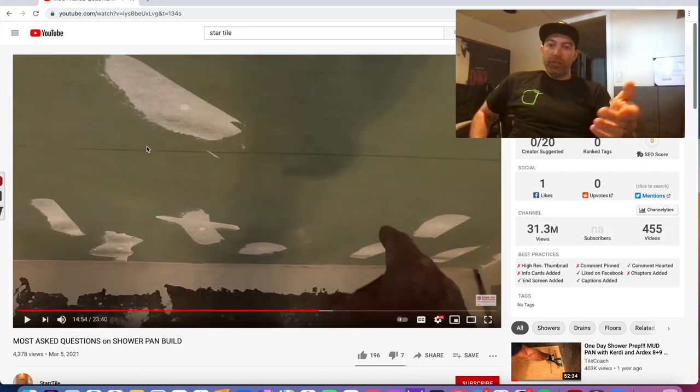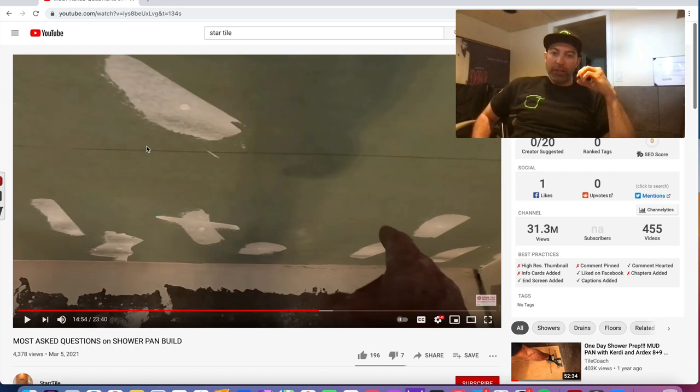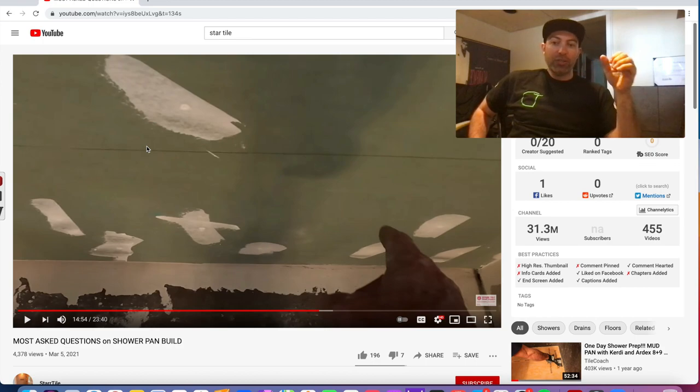So, one thing to point out right here on the video is using drywall in the shower. The only system that the manufacturer allows drywall in a shower for is Schluter. If you're going to wrap the whole thing with their Schluter Kerdi membrane, thin set that bad boy on. I've done plenty of showers that way with drywall. No problems at all. Been back to jobs 5-7 years later. No issues, but the way he's doing it with liquid over the drywall, which we'll get to at some point,